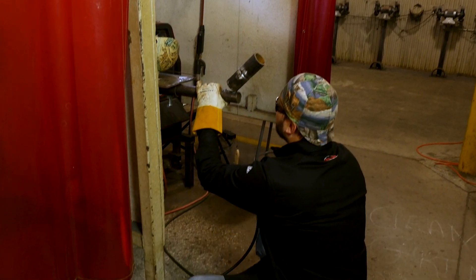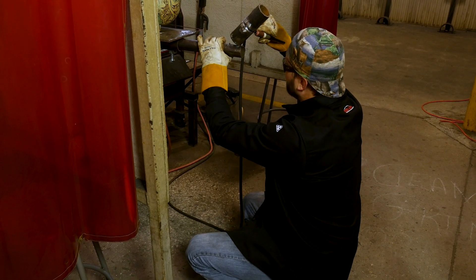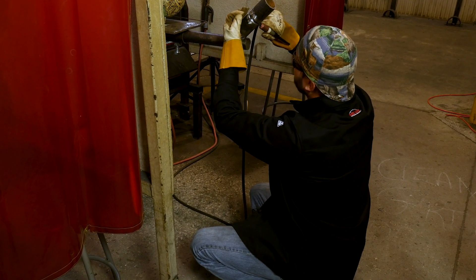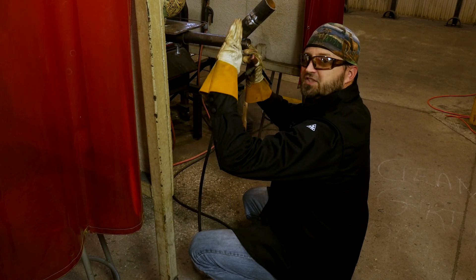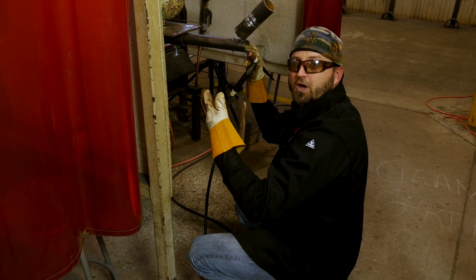Let's go through the left side real quick. Down the left side, it's a lot like a 2G. All I'm going to do is set up basically like a 2G — get down here, bring my wire in from the side, just rocking it back and forth, on and around, and then we'll kind of stand up as we go around the pipe. So the left side is much easier compared to the right side. We've talked about it, now let's actually show you some welding.